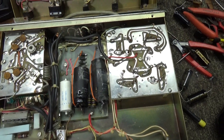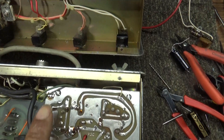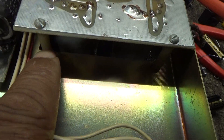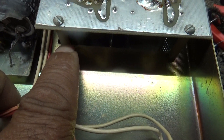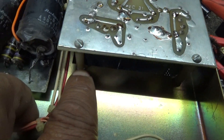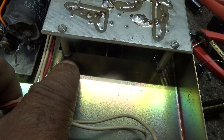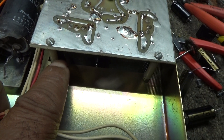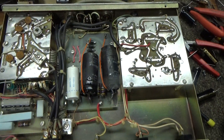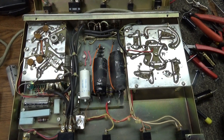One more thing: tighten up these screw terminals — they're used for the ground and they get loose. On some units the standoff under here was paper or cardboard, so the more you tighten it, the more it just pulls into that cardboard and you can never get a firm grip. If that's happening, replace these standoffs that lift the board off the chassis so you can get a good ground — that's very important. That's going to be it on these 300As for today; we'll make another video once we get them going.